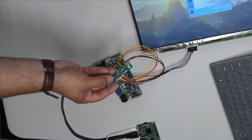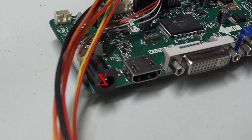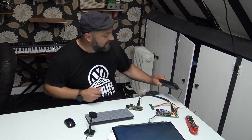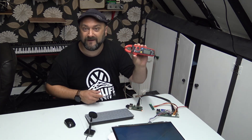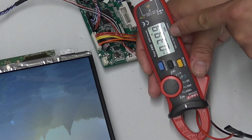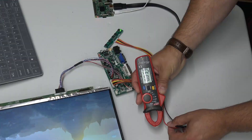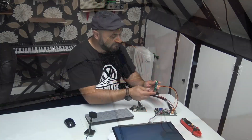This little card has a 12-volt input, so you can connect it to a car battery or whatever power supply you have. I've got an old power brick down here on the floor — actually 15 volts, not 12, but it's close enough, so I repurposed that old laptop power supply and connected it into this PCB. With a current clamp, the draw is about half an amp when the screen is running, so with a group of 18650 batteries — again taken from an old power supply — you could run this display for about four hours.